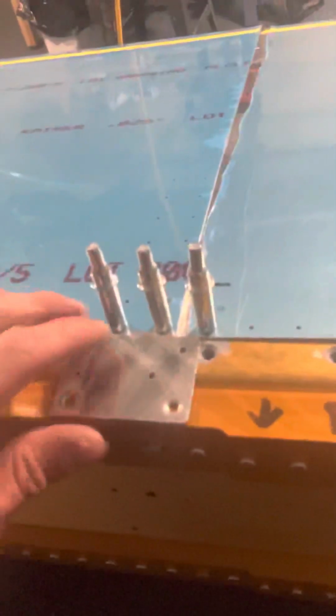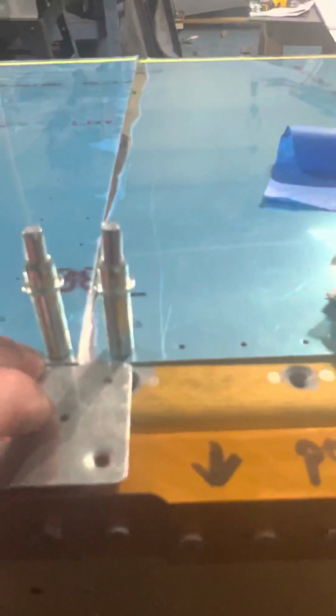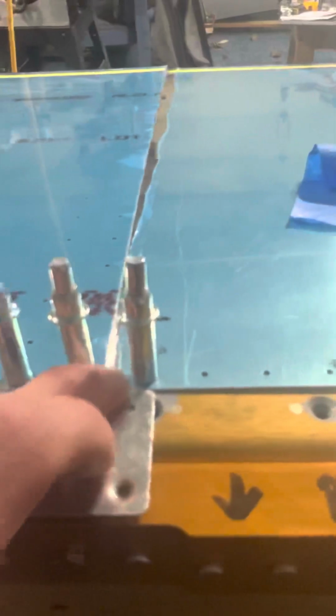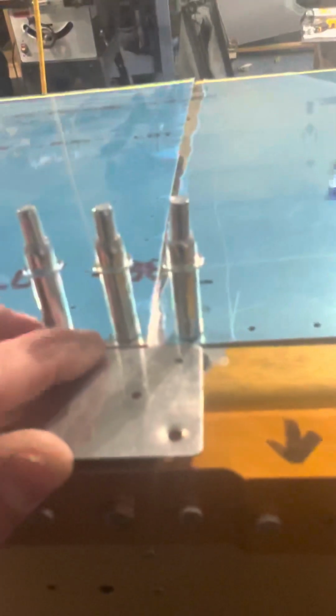But basically, you take your sample, which will appear to be a tank skin, and you just put it on top of the wing spar, and it's looking pretty close. There's a little bit of protrusion here. That's kind of a little bump, but it looks great. I'd rather leave material than take off too much. I would rather leave a little bit of a protrusion here on top, but it looks really good.